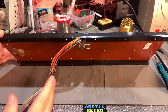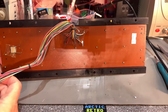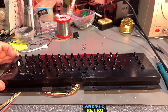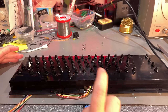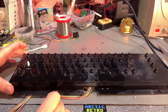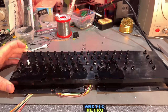So while this keyboard seems to work all right, I didn't test all the keys. I'm still gonna take off the back plate and try to revive it a little bit so that it hopefully works better for a longer time. Just see if I can clean off this dirt. Oh, it's really hard. Yeah, it's like sugar. Well, I'm gonna take all the plungers off so I can clean this in hot water afterwards.